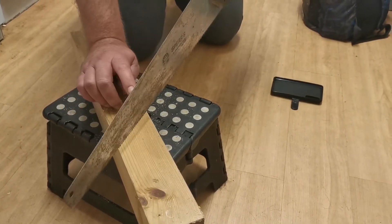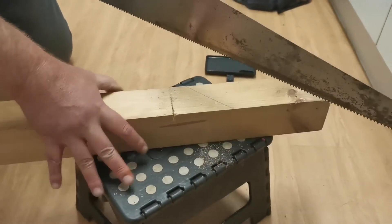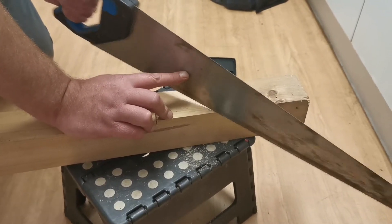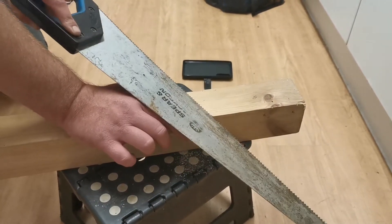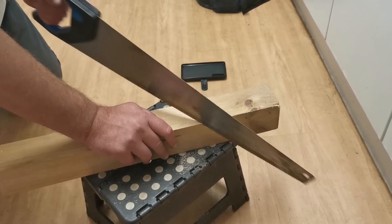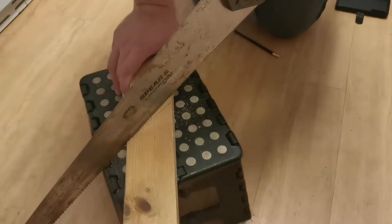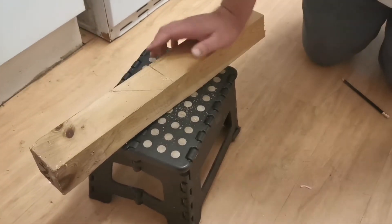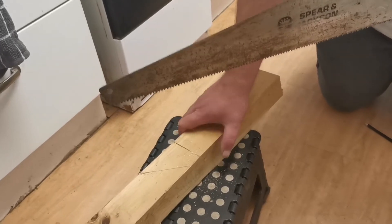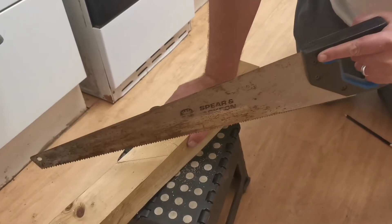I'll place my fingers at the side of the wood at first — not where it's going to touch — just to give it a slight guide. Place my finger here to start, hold it firm, and my finger supports and guides it. It's not jiggling around so much. Now this other hand: don't go here or here — make sure your hand is clear. If I'm sawing here, where am I going to hit my thumb? This is about safety too.